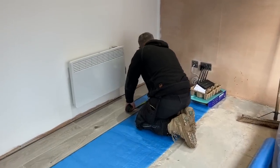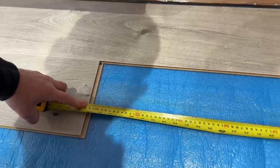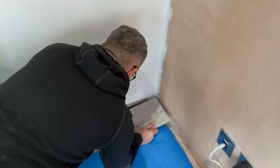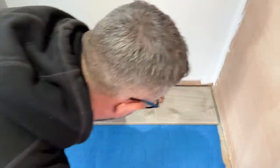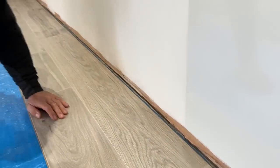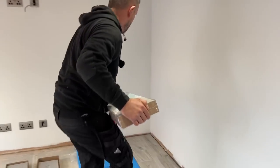I've got my tape measure tight to the wall and I'm reading 923mm, so I'll ask David to cut me 913mm — the skirting board will cover the expansion gap and we've got loads of room. Once I get that board down I'll give it a little tap and check my gap at the back. It's gone down nice, I still have my expansion gap under there. I'll put a couple of packs on the floor now to stop it from moving.